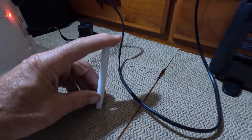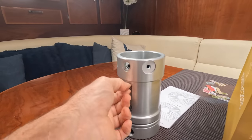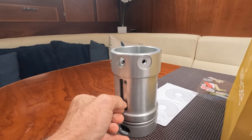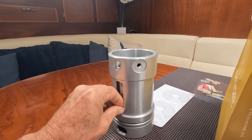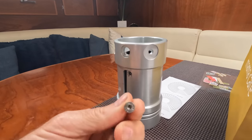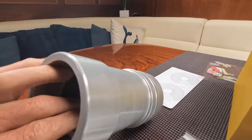So I just ordered a whole new swivel. Here's the swivel for the forestay, and one of the things you've got to watch out for when you get them from Amel is they don't put enough thread locker on the screws. So when you get yours, take these screws out and maybe even change the screws - I don't like the flatheads, I change them to Allen heads. Anyway, pop all this stuff out.